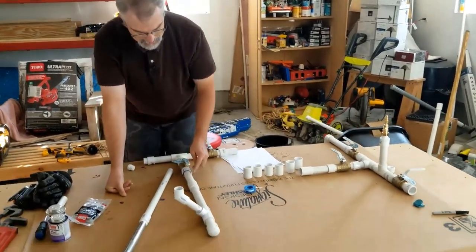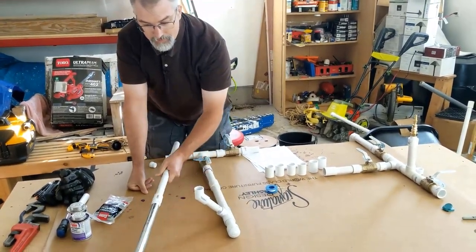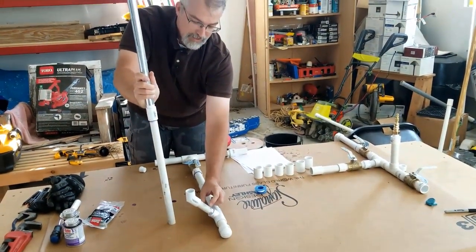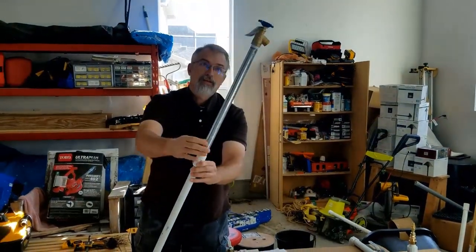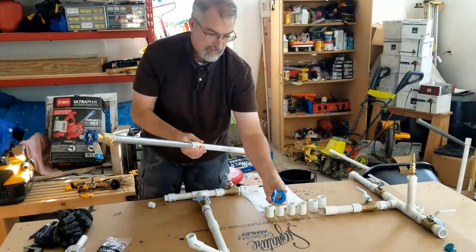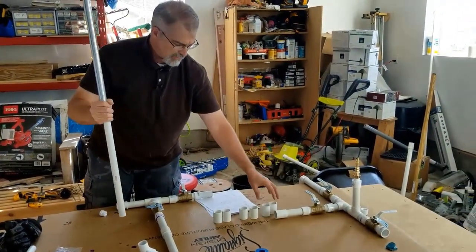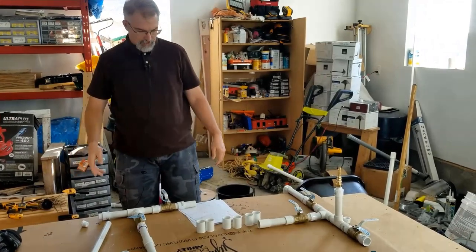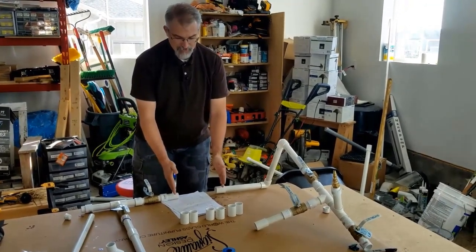And then coming up here, what I'll be doing today is I'll come a little further, and I'm not going to go all the way to my other sprinkler yet today. I'm going to go a little further than what I intend to put my hose bib on. So I have this T coming off, and this T is going to a 3/4-inch pipe, and this is 3/4-inch, but everything else is 1-inch. Then I put this in here, and I may have to cut this, but then here is my hose bib. These are all just threaded. They're not going to be glued, and I have my plumber's tape. So that is my rough plan. Also in between here, I've already laid things out. I have, I think, 6 or 7 10-foot pipes to go from here to my backyard. So that is it, minus, you know, 50 feet of pipe that's going to go in between here and there.